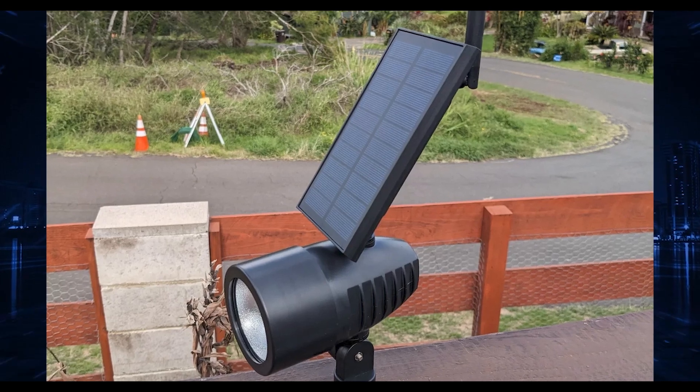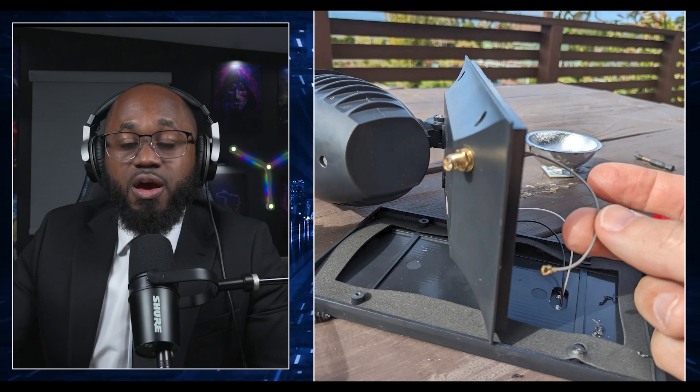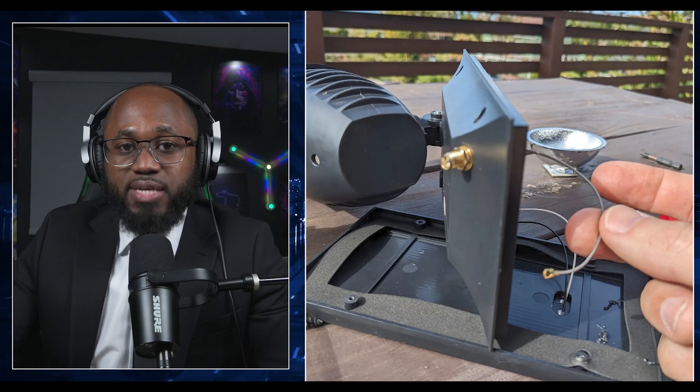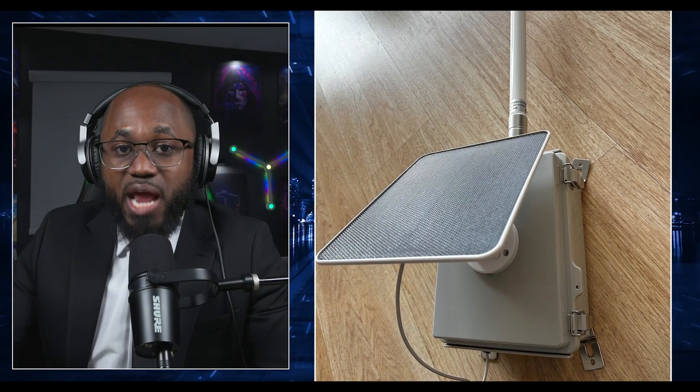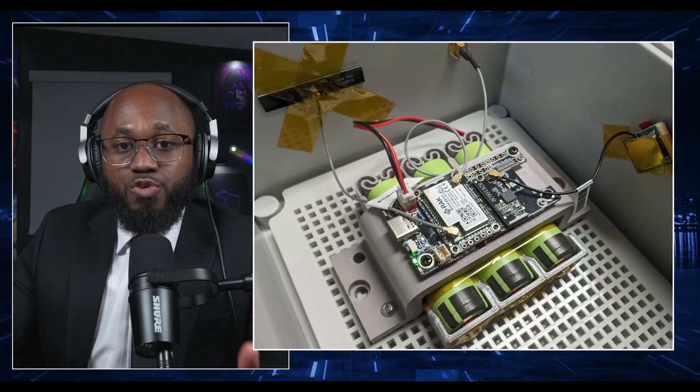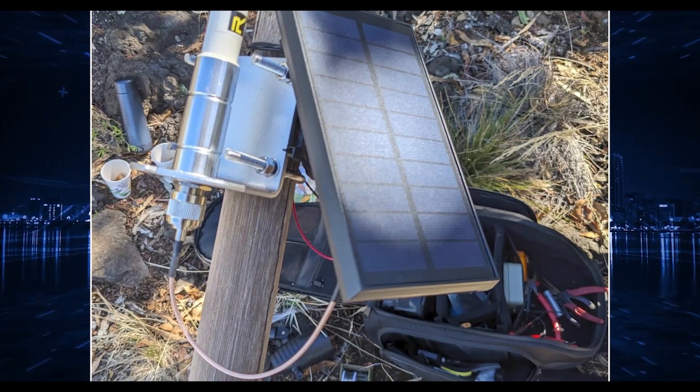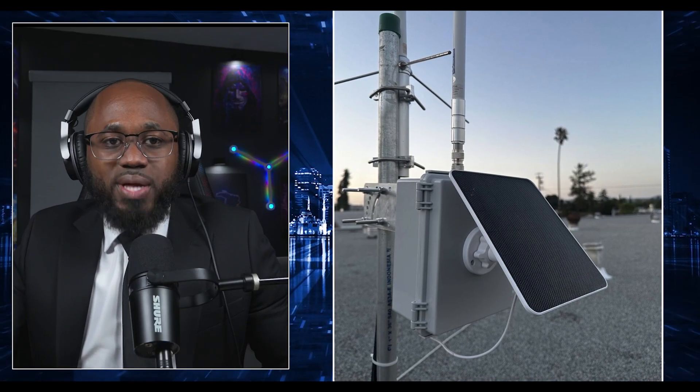Here's the build workflow. First, mount the WisBlock Core and LoRa radio module on the WisBlock baseboard. Then add the WisBlock Power module — the RAK-19012 — for battery and solar panel integration. Connect a suitable solar panel of 4W and one or more 18650 batteries, ensuring correct polarity. Install the assembly in a waterproof enclosure, optionally with a high-gain antenna. Flash and configure the MeshTastic firmware, setting it as a router or repeater as needed. Finally, mount the node in a tree or elevated outdoor location for optimal coverage and sunlight. This approach delivers a robust off-grid communication node for rural, emergency, or outdoor mesh networks with proven reliability in 2025 deployments.